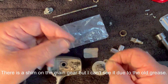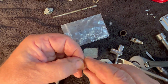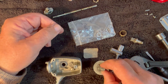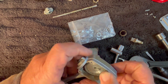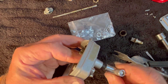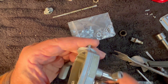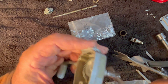Let's take this one. I think it's a 5,000 shim washer. Oh, that's a bent one. We don't want that one. He's oval. That one's oval. We'll throw that one away. Let's try getting a different one. Put that back inside and put the handle on. This is going to be a hit or miss trial and error kind of thing. That's too much of a shim because it made it tight. When I tighten it down all the way it made the gear very tight, so that one's too big.